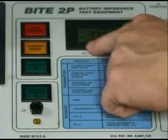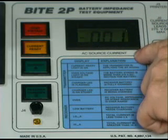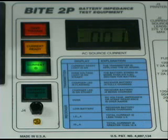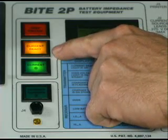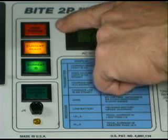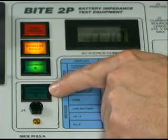When we turn the power switch on, you'll see that the LCD displays the current being applied to the battery. Right now there's zero current being applied to the battery. We'll press the current switch. That will start the current flowing to the battery, but only after the charging capacitors are charged to the bus voltage. You'll start to see that the yellow light is illuminating. And when that's finished, it will read 9 or 10 amps being applied to the battery. We also have an overvoltage switch and a receiver battery charger switch.